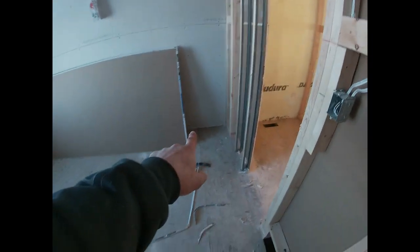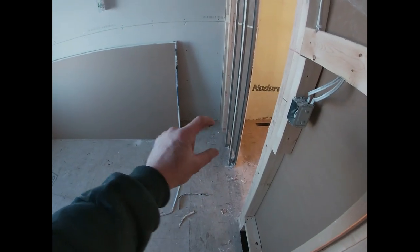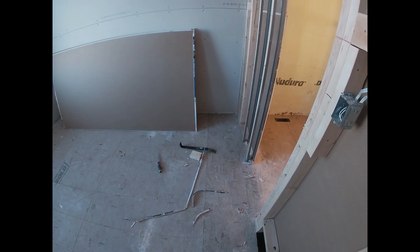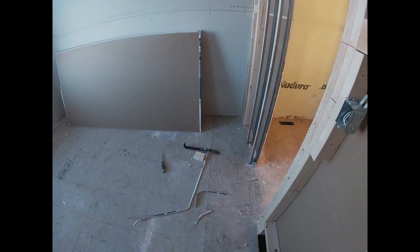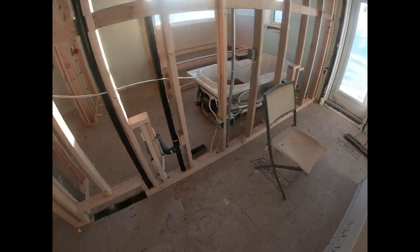Oh, it ended up a little funny, again, because our walls were a little bit taller than 9 feet. So we got a little bit of a space to fill there. I think I'll just get some plywood or OSB or something I have kicking around here just to fill up that gap. And it'll be kind of nice anyway, because it'll have a nice spot to nail the baseboards everywhere, right? We have that anyway at the bottom because of these double plates, but it's good.